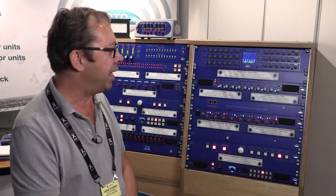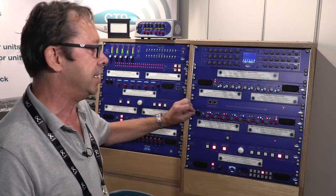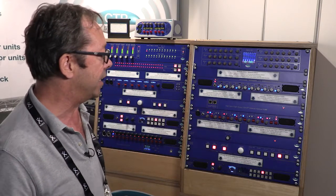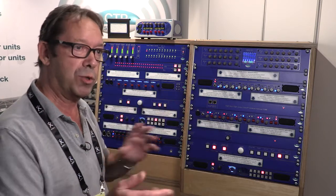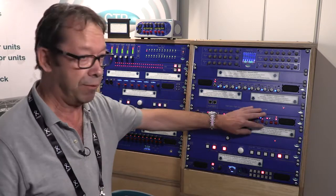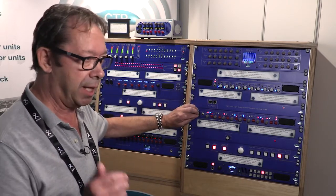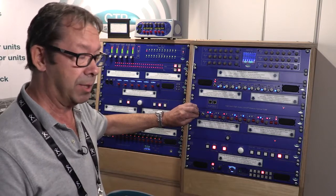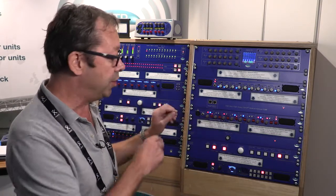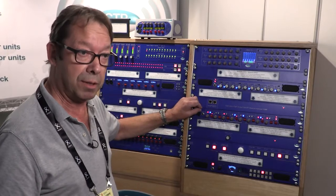So run me through some of what that does. Okay. So you have your usual mic and headphone inputs. What we've done is put any facilities into it that we think anybody sensibly needs. Somebody may have a mix they like set up, so we've put individual cuts on each channel — so rather than altering the mix by turning it down and up again, they can just cut the channel. Every channel has an IFB input as well. It has eight Dante four-wire inputs, eight Dante four-wire outputs, and eight Dante IFB inputs. We've also mirrored the first four on the back as analog, so you can use the first four channels locally. If you don't connect it to a Dante network, you still have a four-way analog four-wire box — we've really gone for flexibility.